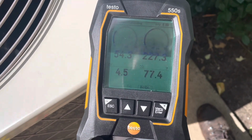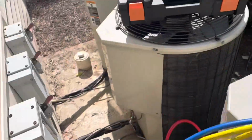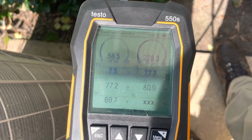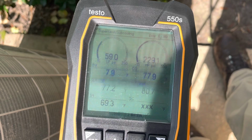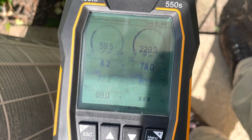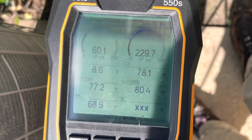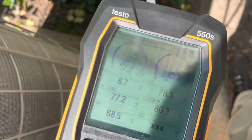We're starting to come back up now, but we're going to be pretty low. Let's get our probes hooked up so we can see what our superheat and subcooling is. I'd say it's low. And it's about 4 o'clock and I'm not in the mood to do a full boat leak search right now. So I'm probably going to gas them up. We'll have to come back and do a more extensive leak search. I've already been looking for about 30 minutes now, haven't found anything. So I'm just going to gas them up for the night.